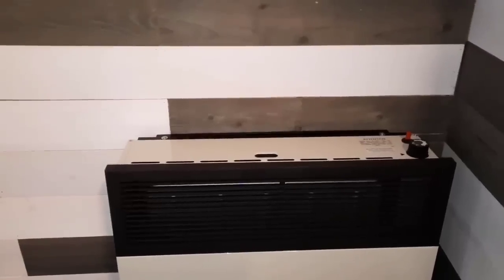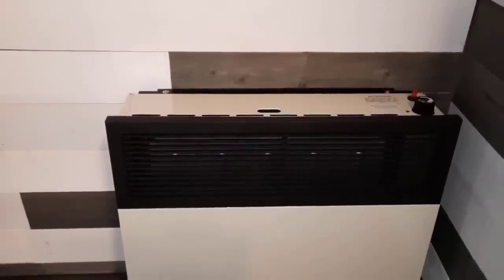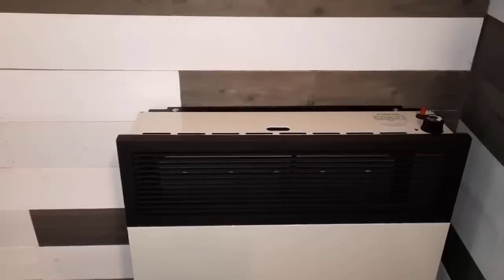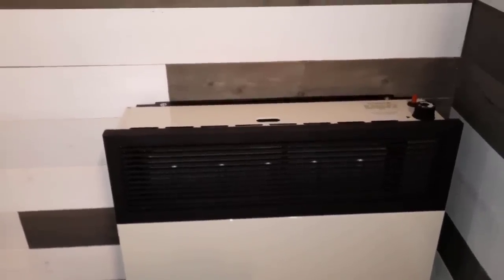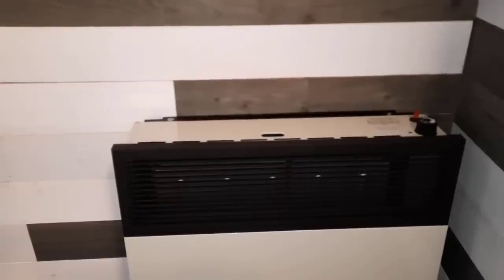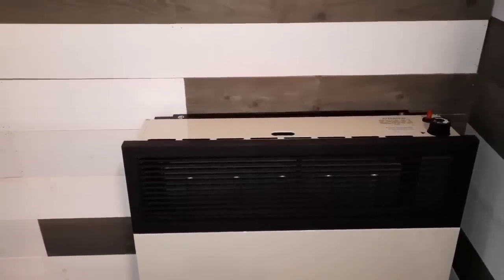This is an Ashley direct vent propane heater, and we'll get into what it means that it's direct vent. I purchased the larger one because it was only about $50 or $60 more than the smaller size. This one is 17,000 BTU. Just so you know how to convert BTUs — one gallon of propane has approximately 91,000 to 92,000 BTU.